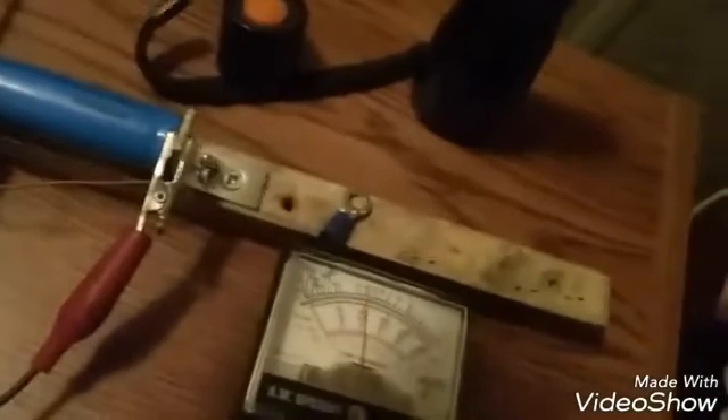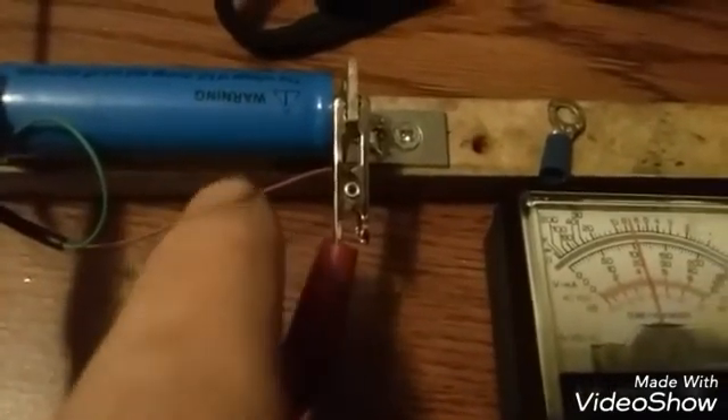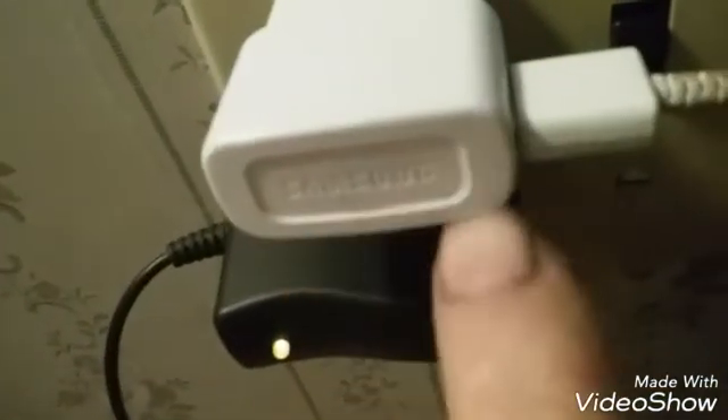If you don't have a plug like this which tells you when it's charged, you can use a plug like this — whatever plug you can plug into a USB port. Basically you will cut this off and you would find your positive and your negative wire. You have your ground and your positive, your negative wire, and you can make your own charger. It's very simple. The only thing with this is it doesn't have an indication light.